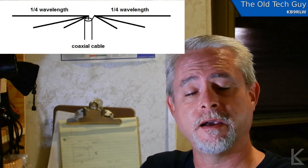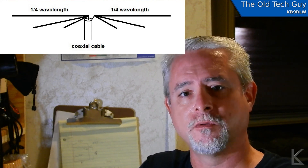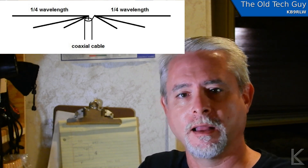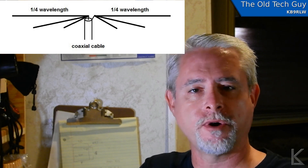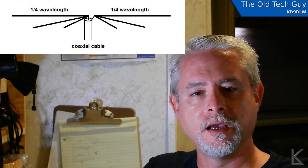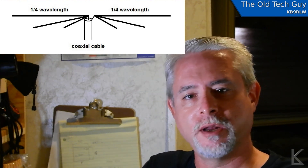That's a great idea. It would be good for a permanent antenna, but you're going to have a little extra work hanging it and supporting those other legs — not very good for a portable antenna. But what if you wanted a good portable dipole for 80 meters that would cover pretty much the whole band with low SWR? For portable, you'd want it to be pretty easy to put up — really only one anchor point for the legs and maybe a support for the center.